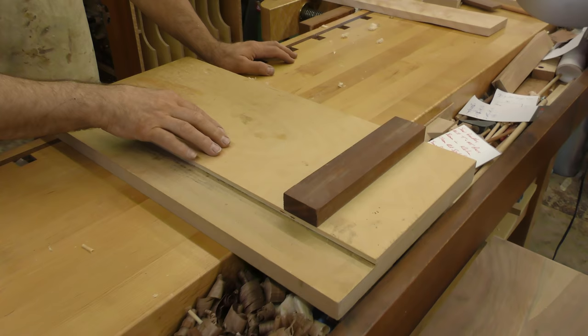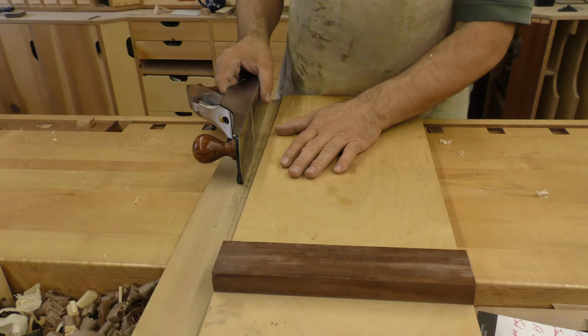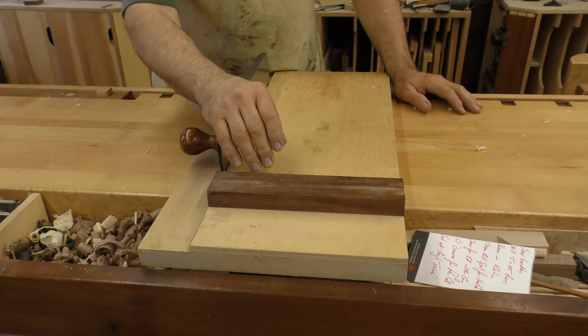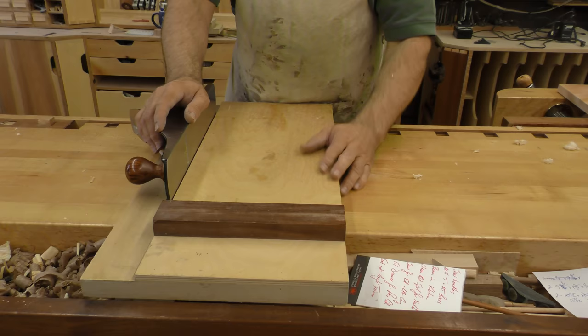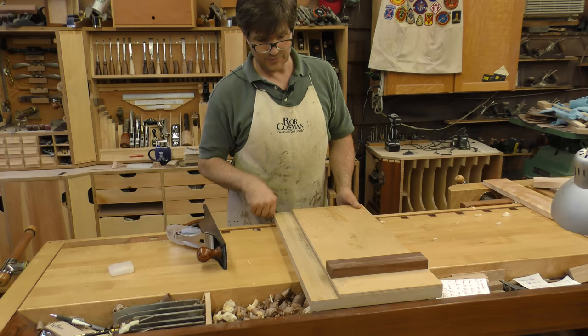The second piece, I like to use Baltic Birch. Nice stable product again. The reason you have to have the second piece is that when you use your shooting board, this piece has to elevate your wood or your workpiece so that you get into the blade, and you get by this area right here where there is no blade on a typical bench plane. The third material I use is something really hard — a piece of Jatoba. It's a very dense tropical wood, nice and hard. That gets a fair bit of abuse over the years, and if you want to prevent it from getting all marked up or full of dents, you need something nice and hard. I use the same thing down here as a cleat to prevent the shooting board from moving forward when you're using it.